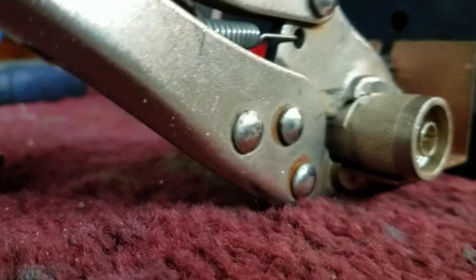Thanks for putting up with this video. I thought while I had all my test equipment out and my cell phone handy, I'd shoot a quick video and show people how I test the connectors. If you buy a good quality UHF connector and not garbage, they're really pretty good. If you get garbage, they're a big trouble — you just have to watch which connector you buy. UHF connectors are pretty much all anybody needs if they work below the two meter band. They'll handle a ton of power, and as long as you weatherproof them, they're a real good connector.